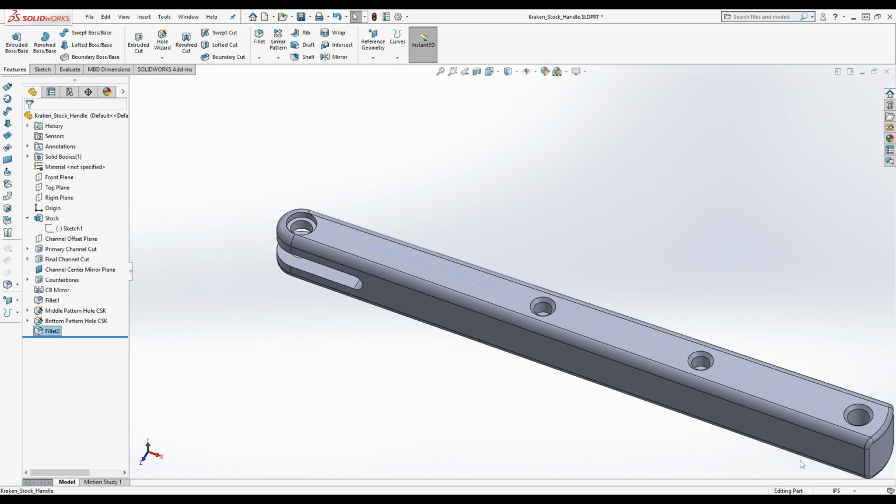If you really wanted to figure this out, there's a few different ways you could do it, okay? The easiest is going to be taking a few different size drill bits that you think might be the size, resting it in the slot. If it rolls around, like resting it lengthwise in this slot, let's say you think it's 3/32 of an inch, you put a 3/32 inch drill bit in there and it can kind of roll around in there, that means the drill is too small, okay? If you put it in and it doesn't roll around, that doesn't mean you found the right size. It could be too large, okay?